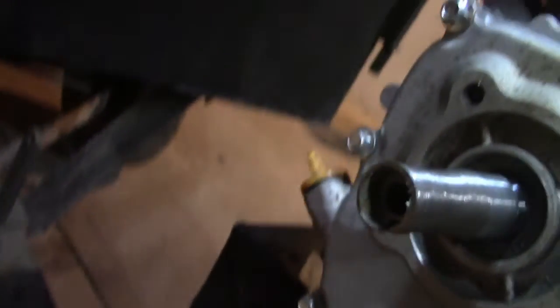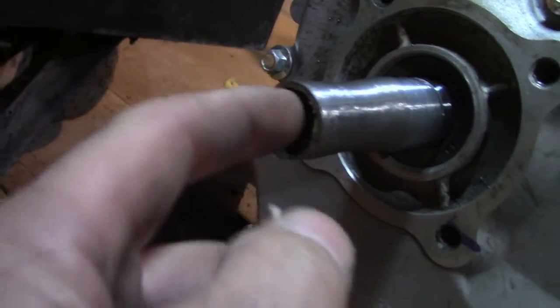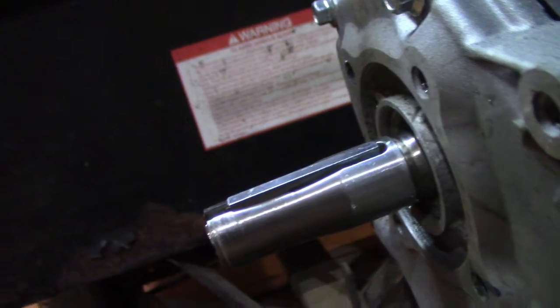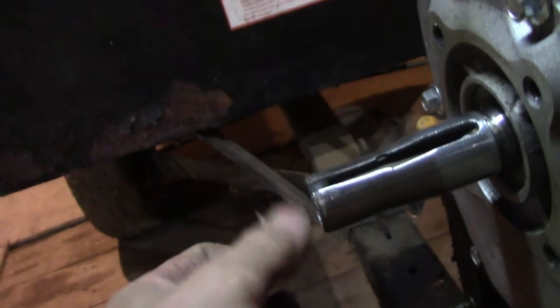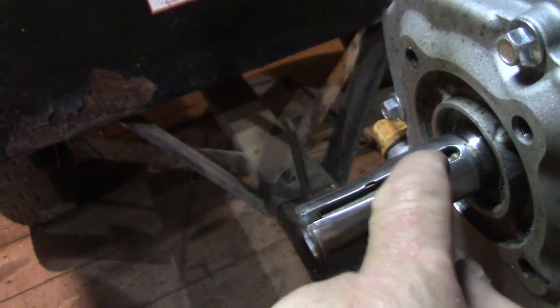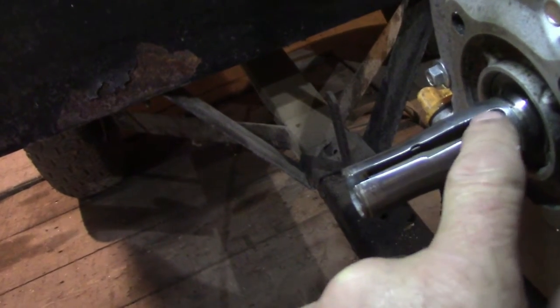The bolt — originally the shaft is shorter, but we just made it longer. The bolt will go in there; I think it's 5/16th, 24 cut. We're almost done here. I'm going to weld this right to it. I was going to use a key, but then I'd have to grind that down — it's a pretty good grind — and I don't want to mess up my new stuff. It's pretty much on there and not really coming off. So I am going to just weld in there like a keyway — two spot welds, one deep, one out here, and maybe one in the middle.